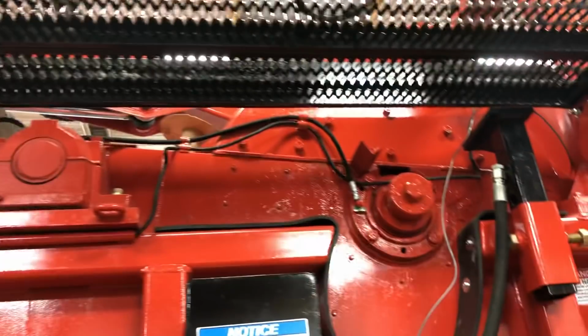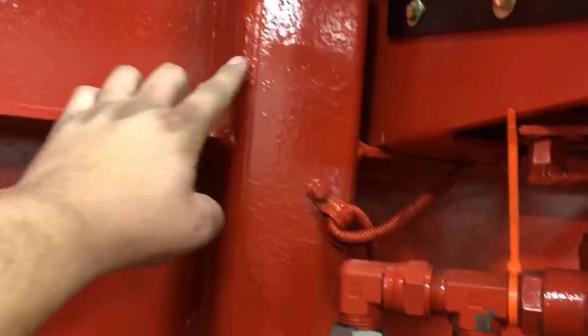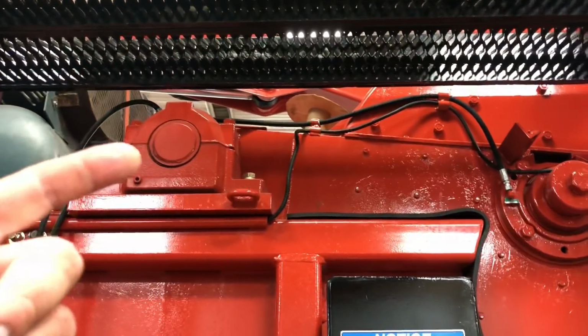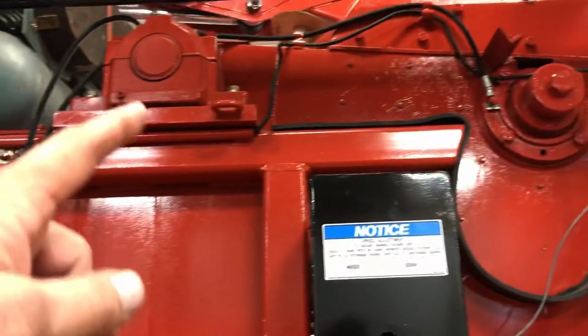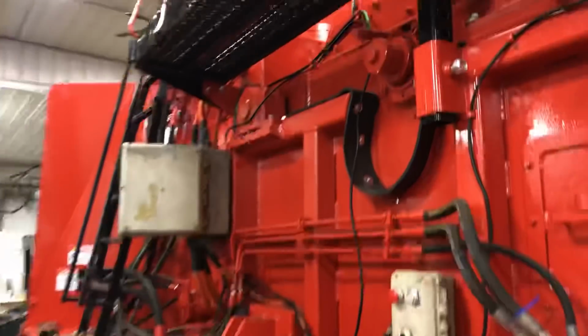So like this bearing here usually always comes out around and down, and you can see where there was a tab right here welded on that you could grease that. The problem is you have to get up top to still grease that. So double them up, run hoses down here. We'll put another fitting right here where we can put two of them. Then you can grease that bearing and that bearing at the same time. Just making it simpler, more simple, simplest.